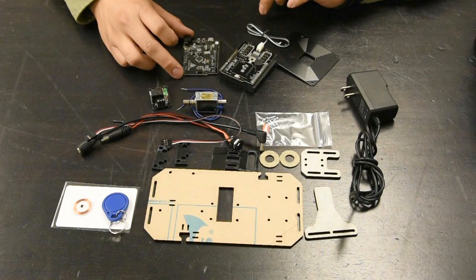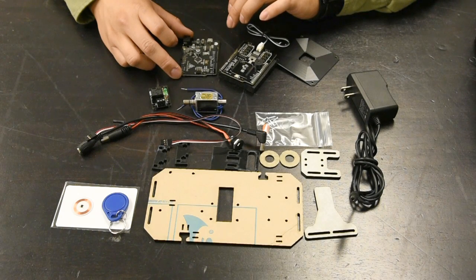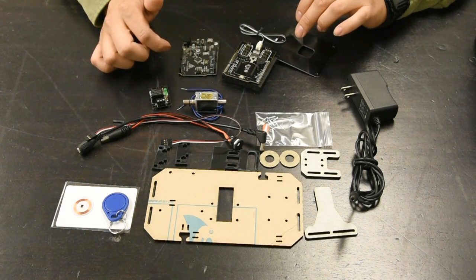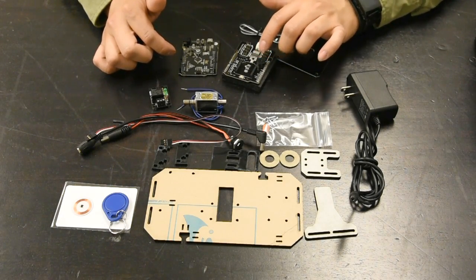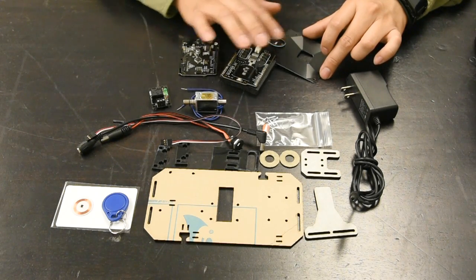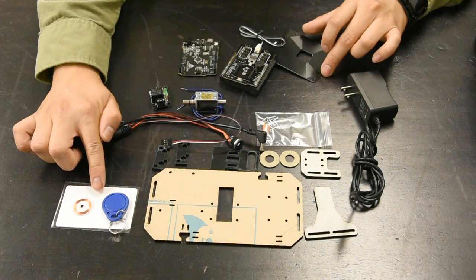At the heart of everything is your Geek Duino — this is an Arduino-compatible board that you can program with the RFIDuino lockbox behavior. All the code is available from learn.robotgeek.com with tutorials and free for download. You'll be able to use this RFIDuino shield by placing it right on top of the Geek Duino, and that gives the Geek Duino the ability to read RFID tags, as well as a buzzer, LED, and an XBee socket. The shield plugs into an antenna that allows you to have your main RFID reading surface away from the rest of your electronics.